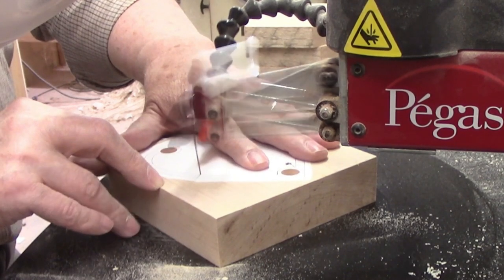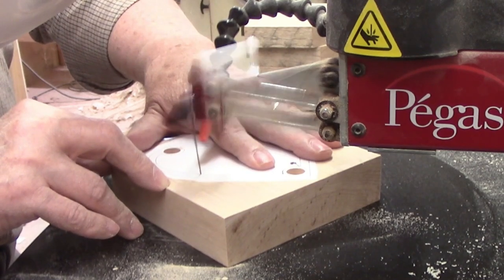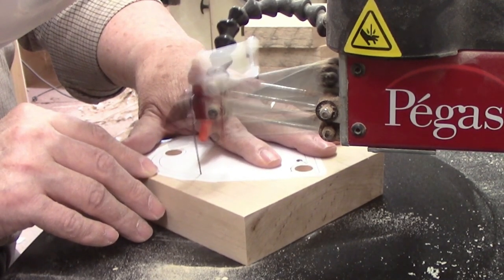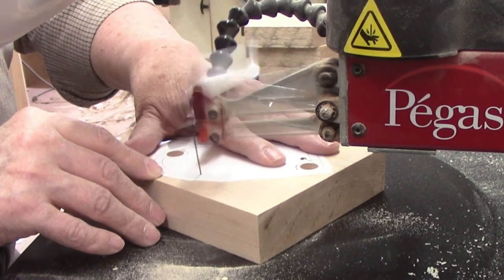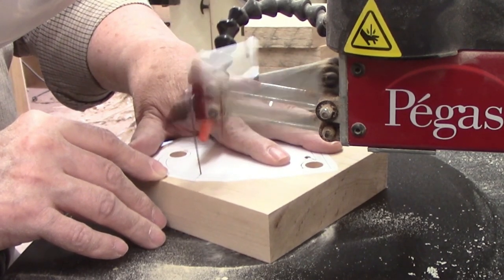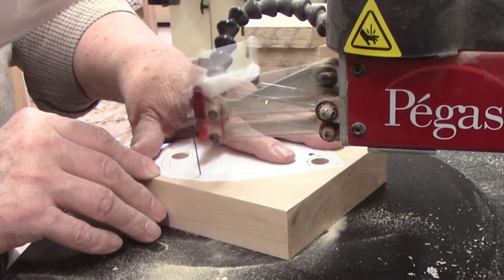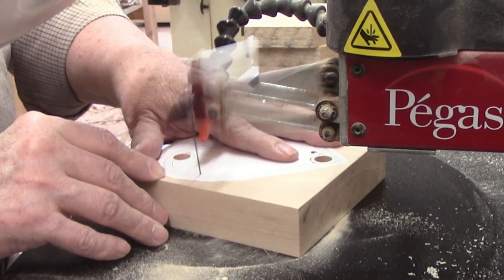top and box surfaces. I don't know about you, but I have to watch myself when making long cuts. They seem to be moving at the speed of a turtle on Ritalin, and if I'm not careful, I find myself putting extra pressure on the material to try and make the cut move along faster. This is not a good idea. One problem this can create is the extra pressure will cause the blade to flex, and you'll no longer be getting a cut that's straight up and down and 90 degrees to the table surface. Or this could cause the blade to overheat and start burning the wood, or cause the blade to break. Take your time and let the blade do the work. Scroll sawing is not a task for impatient people.